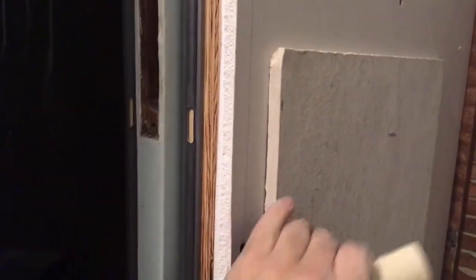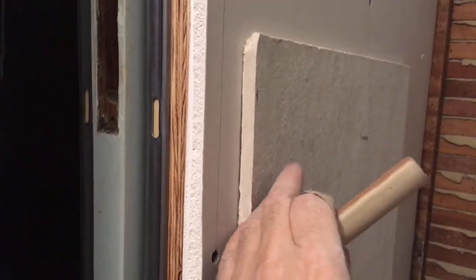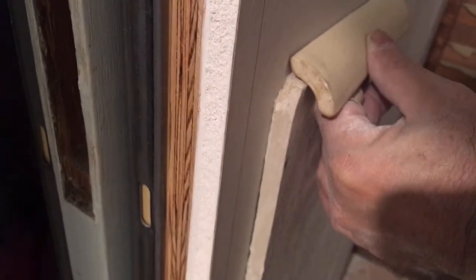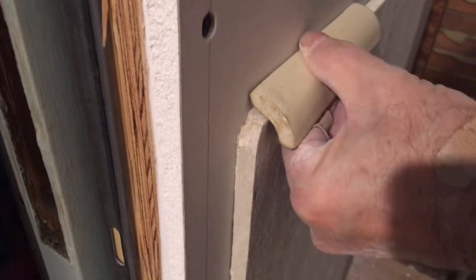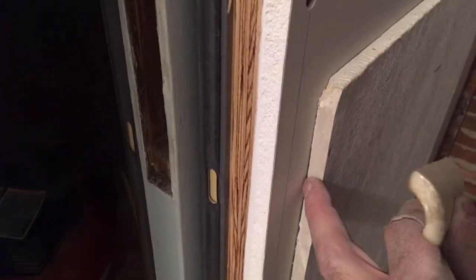Finally, there's going to be cement board on this wall. It'll make it very rigid for the pocket door, since this is not a regular stud wall. This last piece of cement board is going to be on here because this is the bullnose tile that will go along the top of the shower stall. Since it's going to have this depth of the bullnose, you need to add material here to rest these tiles on.